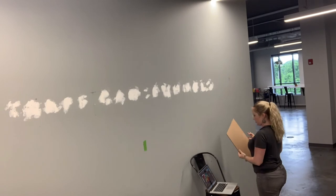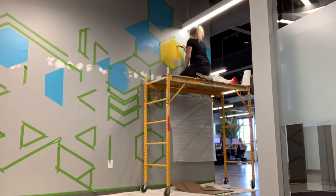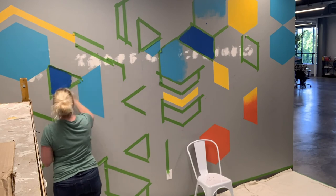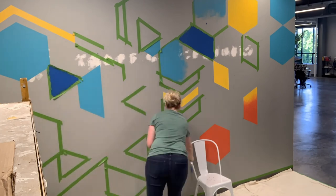So what I did was take a stencil, draw with pencil, and cover the entire wall with the plan in pencil. Then I marked what color was going to go where so I could keep track. Then I used the Frog Tape. I didn't cover the entire wall with tape at once because I knew I'd be working section by section and couldn't put Frog Tape over wet paint. I planned accordingly and worked in sections — that's part of what took so long, but being so careful made it worth it.